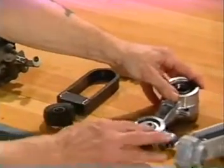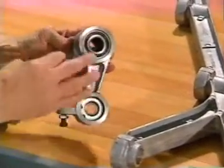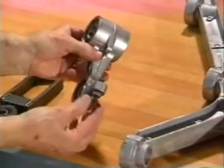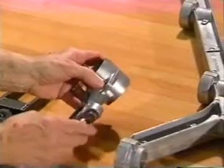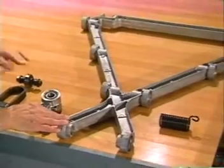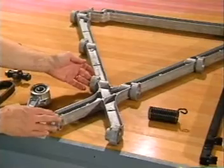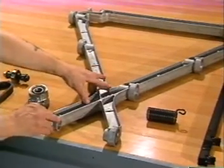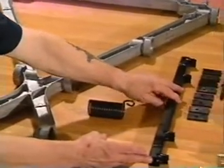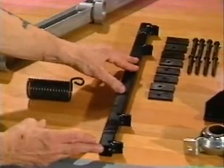The yoke that is part of the table assembly is attached by 4 legs. There are ball bearings in the top of the legs, spherical bearings in the bottom, and the adjusting screw is used to give this yoke the proper angle so that the pins are spotted on the toe. We would inspect the yoke assembly for any cracks or fractures, the condition of the shafts and bearings. Should the yoke be broken, it can be replaced. However, we do have a Yoke Repair kit that we can use to make a quick fix. There's actually enough material in a Yoke Repair kit to make 2 repairs.